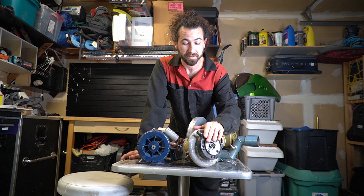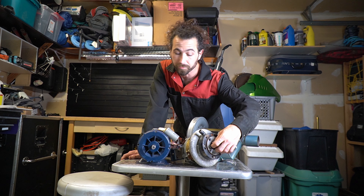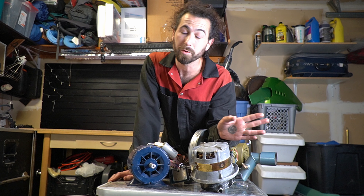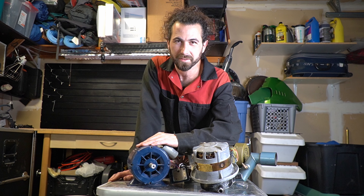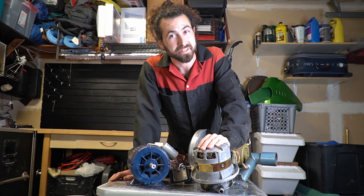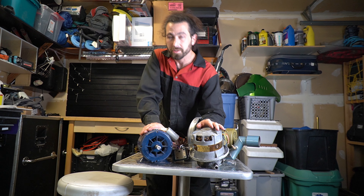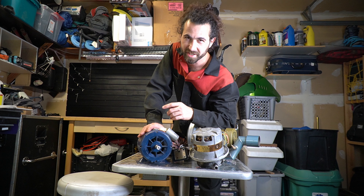With something like these smaller ones though, a little 120 volt motor, it's as simple as that. You just spin the thing, make sure it's free and the bearing isn't making noise, then you can just wire it in and see if it turns on. One final point: the bigger a motor is, the harder it's going to be to sell. A little quarter horse or one eighth horse might fit a whole bunch of different tools, or even better if it came out of an appliance and you know what appliance it is. After confirming that the unit is absolutely definitely never getting put back in service, let's see if they're worth taking apart. The guy at the scrapyard told me they definitely are not, but they're always after me lucky charms, so I don't trust him for a minute.